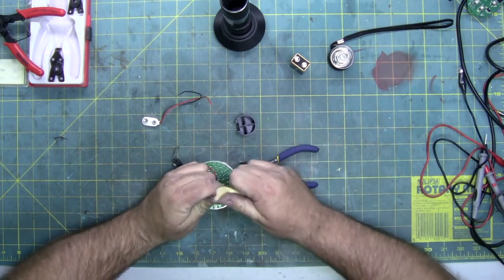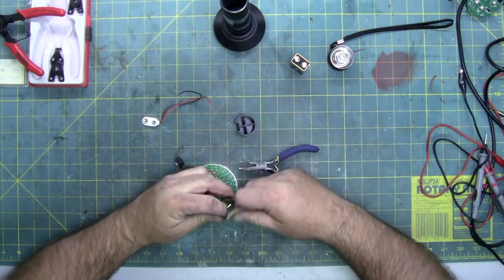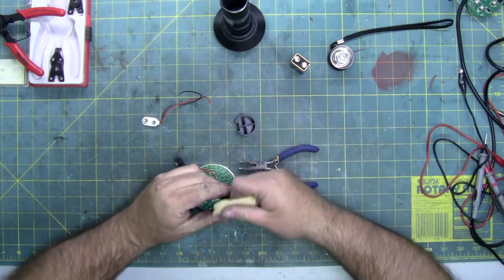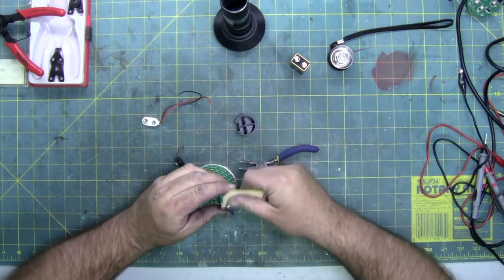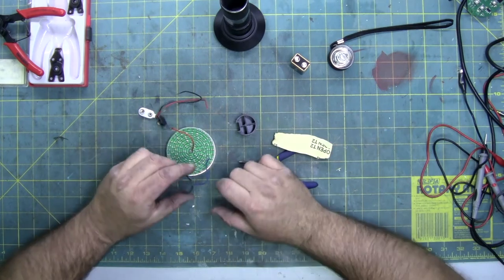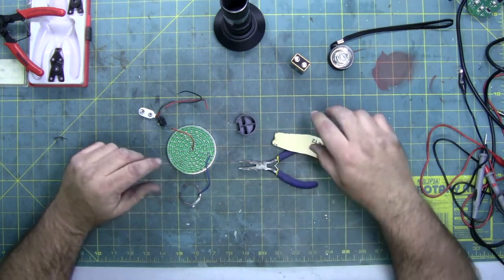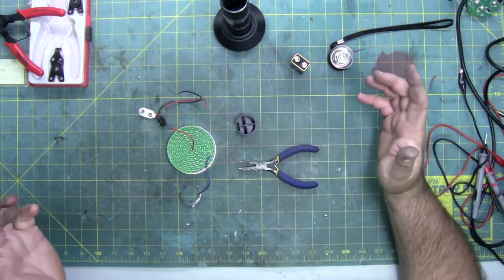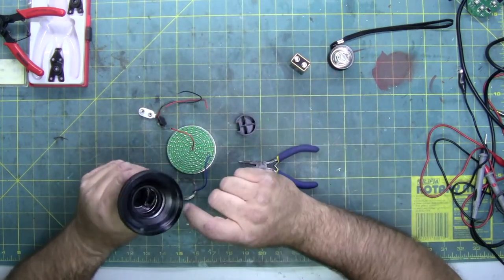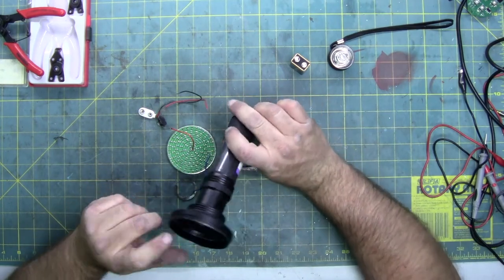Most flashlights out there, especially if they're used outdoors, in rain or snow, you will build up corrosion on the inside, not only if the batteries explode like this one. I'm not going to clean the whole ring. I'm just doing the contact area and a spot up top so I can solder the wire on. If you want to do the whole ring, you can do it. I just need enough surface area on the edge to fit on the inside of this lip, which is still shiny because it's aluminum and the battery acid didn't get that high into corrosion.